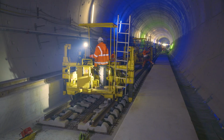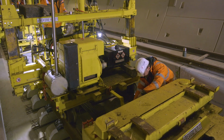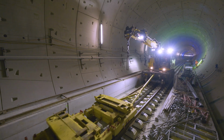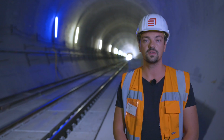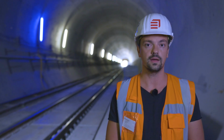The grippers are now retracted again, and the 10 track lifters are assembled, coupled to the bogies and the excavator used to pull them back to the pre-assembly site in the trough. There, the next completed track section is already waiting, thus achieving high efficiency per day shift. Using this installation technique, we have laid up to 360 meters of track in the tunnel tubes and troughs.